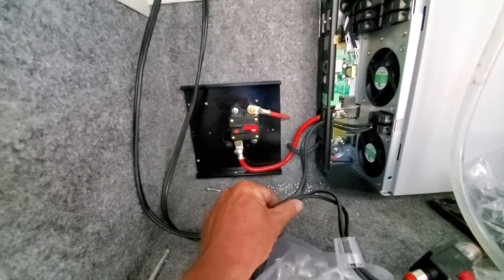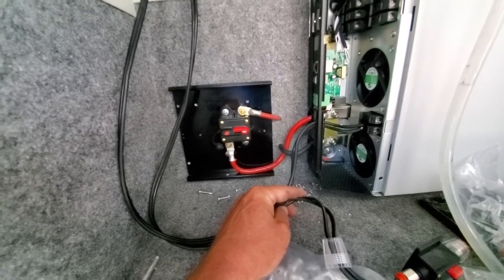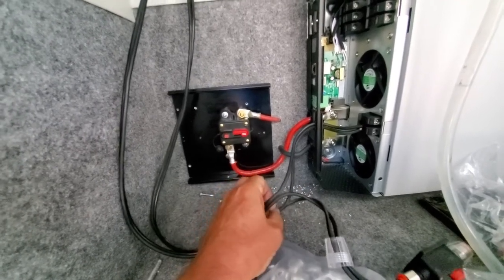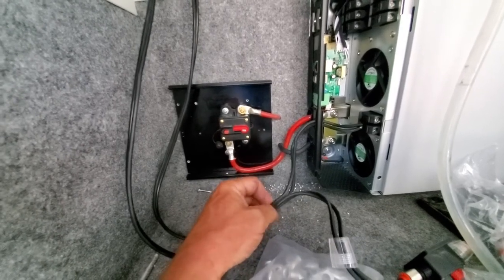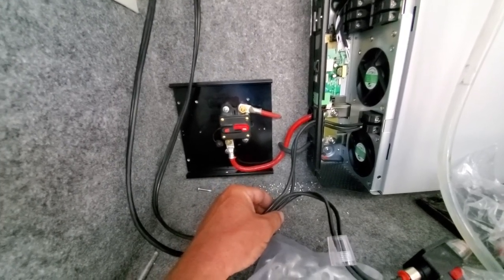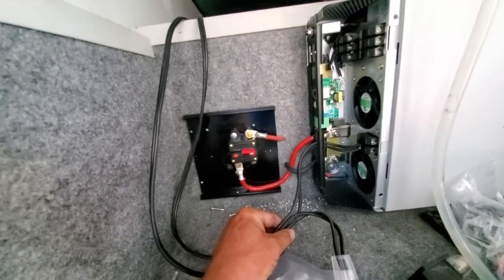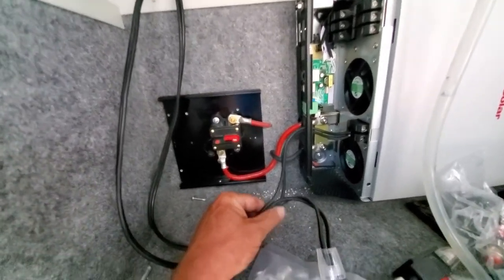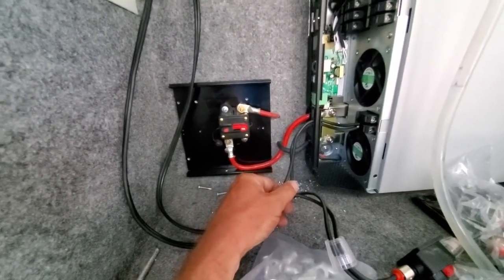They're 340 watt panels. They give out 37 volts each. And so I wired them separately like this, so that if I want to put a 48 volt system in future, you cannot charge a 48 volt battery with 37 volts. I know it's amazing, but it's not possible. So that's why I would connect these 2 wires in series in the future to have like 60 volts.